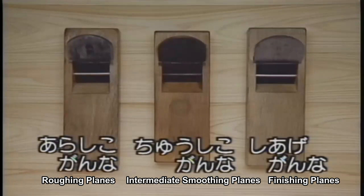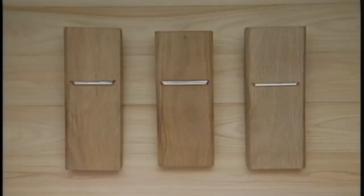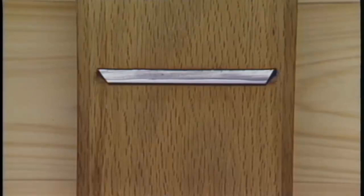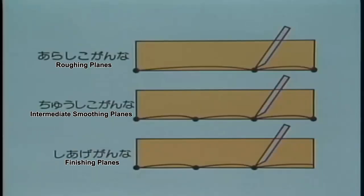If we take a look at just the roughing plane, intermediate smoothing plane, and polishing plane, each one has a different amount of blade protrusion and mouth opening. The way of making the stock straight differs for each one too. When planing pillars and other items you pull the plane over. A roughing plane is designed so that the toe and heel of the sole and the cutting edge touch the wood — everywhere else floats above the wood. An intermediate smoothing plane touches the wood in four spots. A polishing plane touches the wood in three spots, but usually the front of the sole floats. When we say float, we mean only by a tiny amount, about the thickness of a sheet of paper.